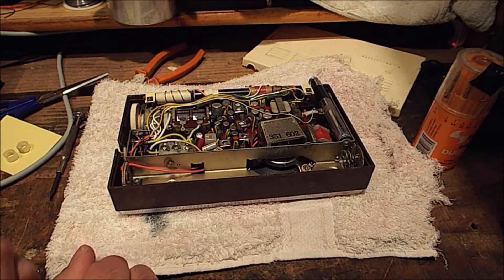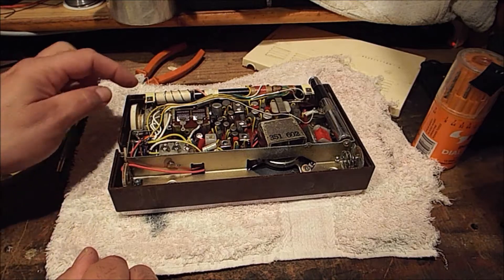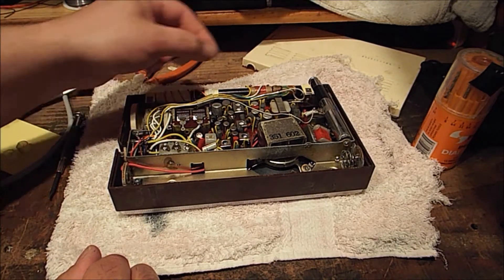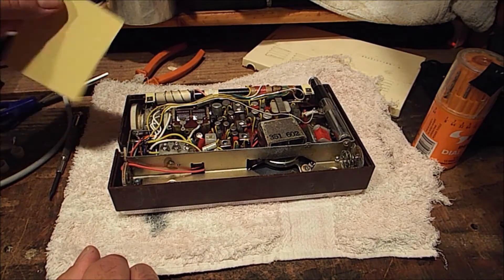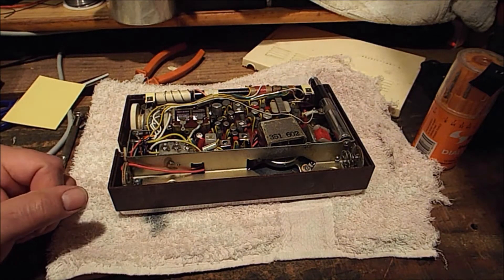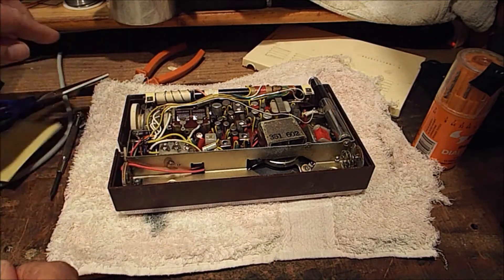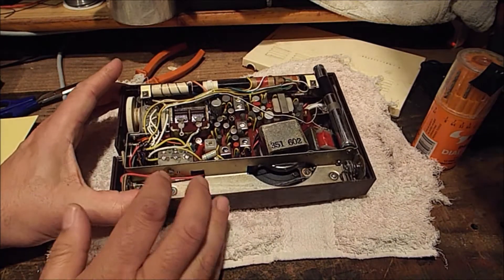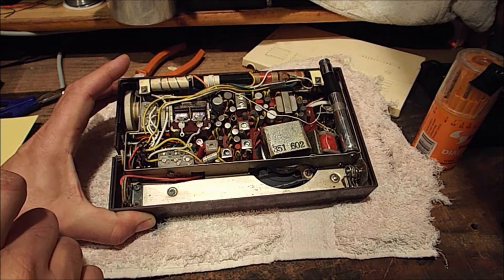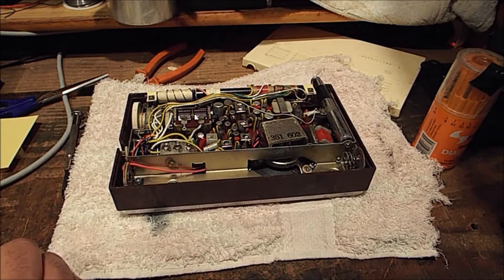Time for an update on the Bel Air shortwave portable radio. I've got around to replacing the ferrite rod clamps at either end. I've gone ahead and just used plastic off of an ice cream tub — not a bad plastic. I'm also going to need to spray some contact cleaner on the contact surfaces and give it a general cleanup.